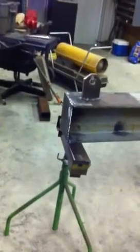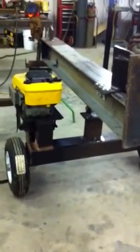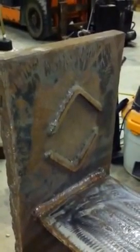I just got through welding the pivot points on the reservoir axle to the main beam. Put a little spacer in there to create some height so where I mounted the pivot point would give me room to actually pivot it down. When it's in the down position there's no play — it all fits flush with the level floor. I've got my ram locked in place so it doesn't slide up and down as I'm pivoting the beam. There's my cylinder rear anchor — a couple of pieces of angle iron welded in place to keep the logs from flying off.